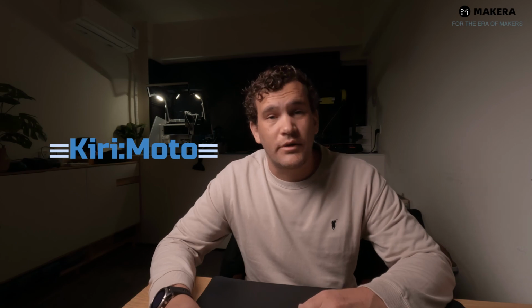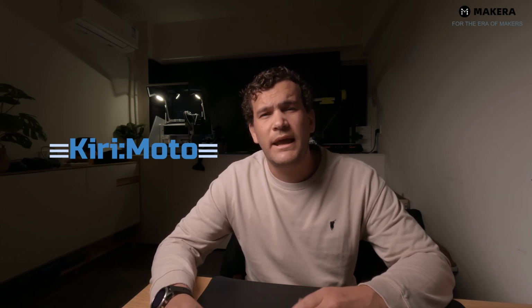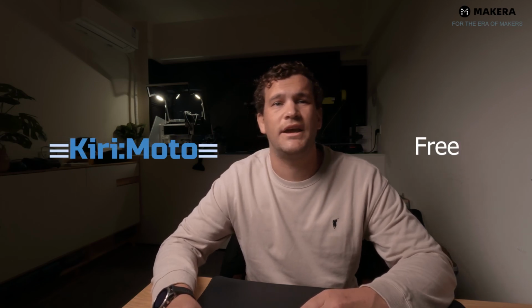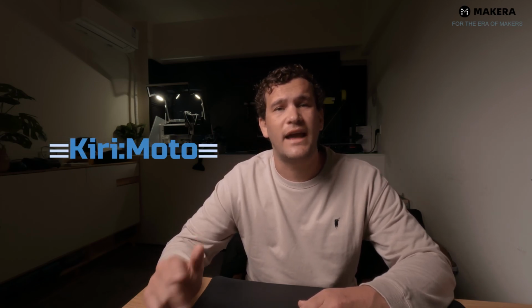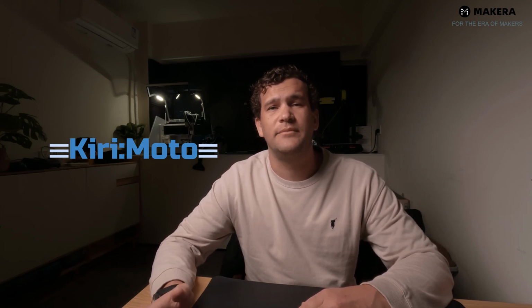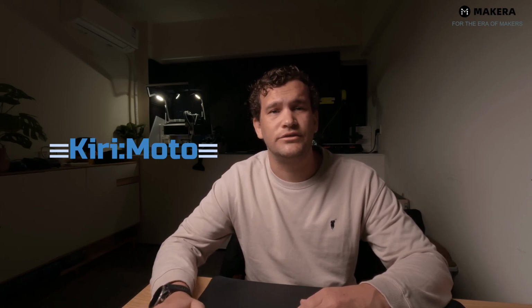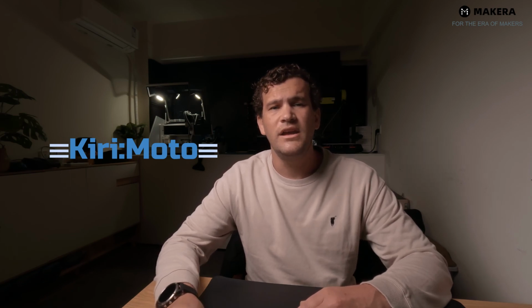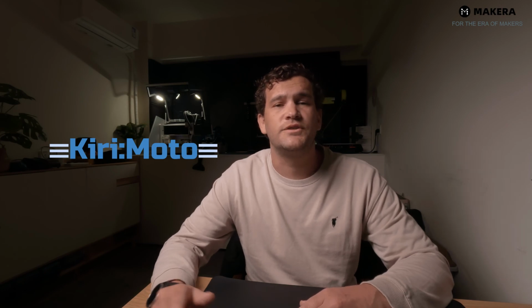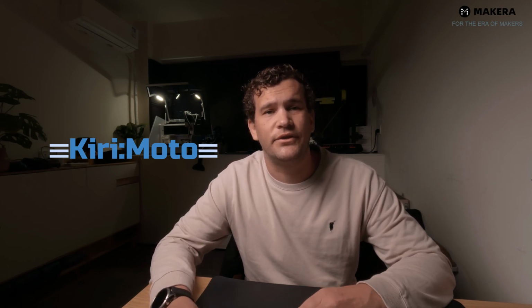Your other option is Kiri Moto. It's a new player in the CNC game. It's a free open source browser-based application for CAM, 3D printing and laser output. There's no software to install, and all data and processing happens privately and local to the browser window. It supports all the milling functions that you would need, including tool changes. It also supports cutting in the 3rd axis and the 4th axis.